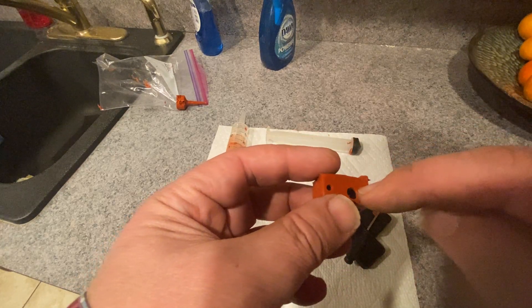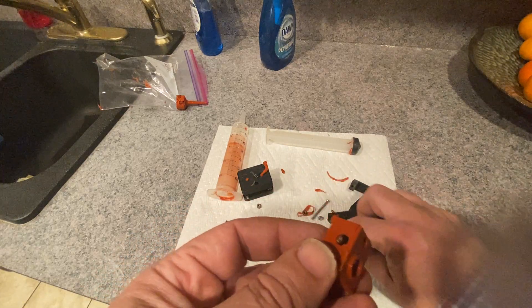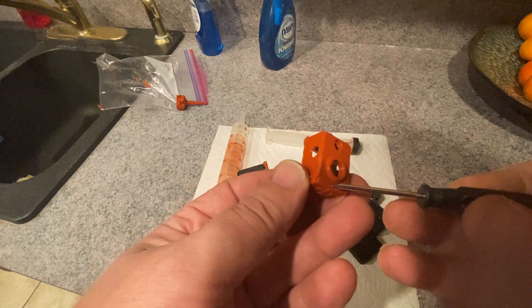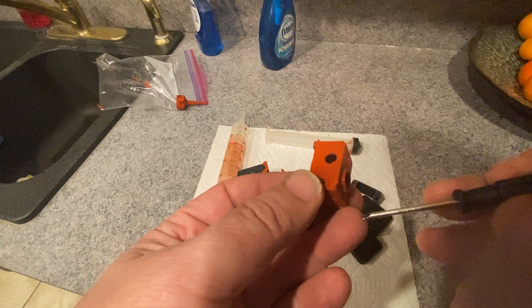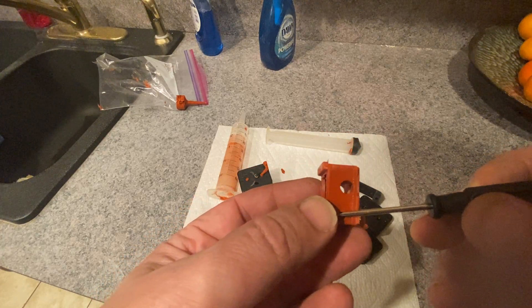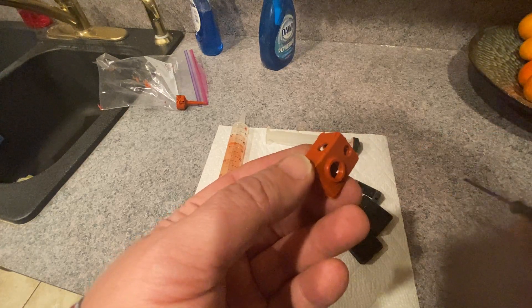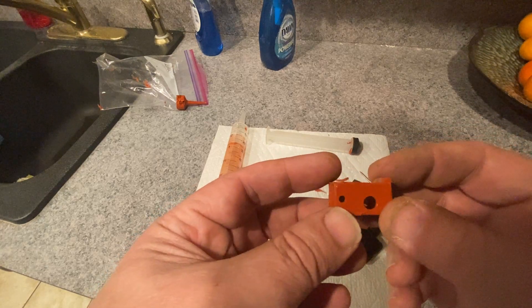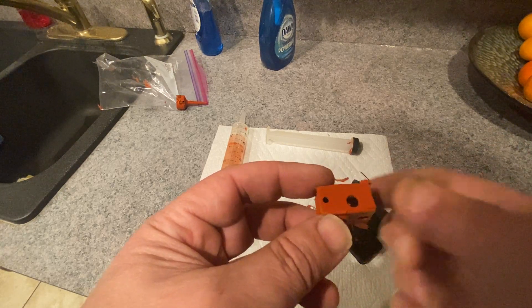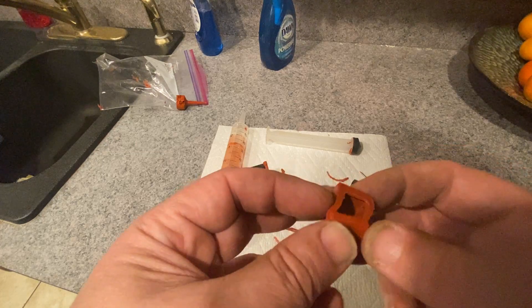I normally put the sock on the block first, then insert the thermocouple and the heater. To tighten up the thermocouple — they're so thin — you can basically just puncture through here with your Allen wrench. You can kind of feel where the hole is and just puncture through the silicone, stick the Allen wrench through there, and tighten up the screw holding the thermocouple — or RTD in my case. Then the same thing for the heater: stick it in and tighten up this screw. By doing that you fully cover the block with silicone, so there's no gap unless you do something wrong during assembly. You also get better insulation, and best of all the sock never comes off.